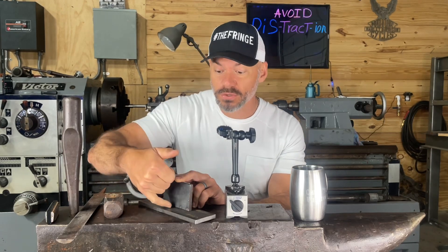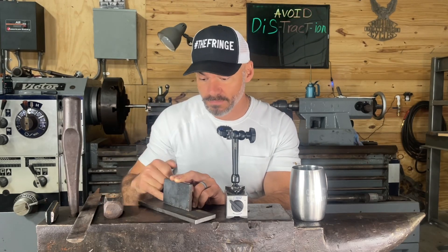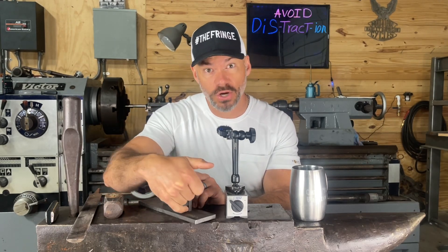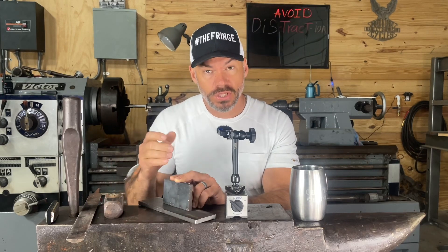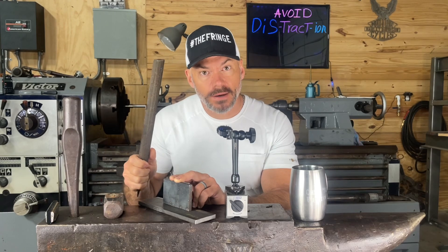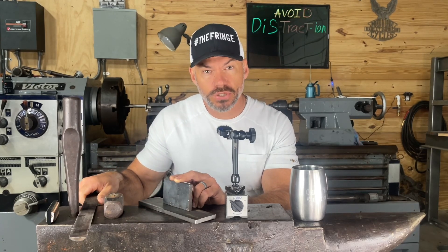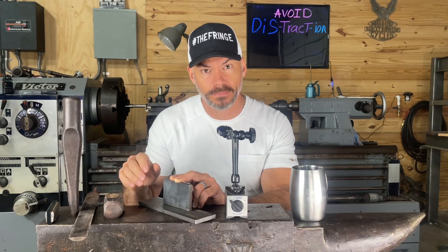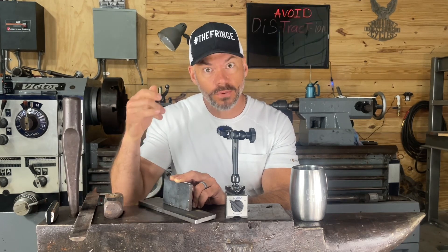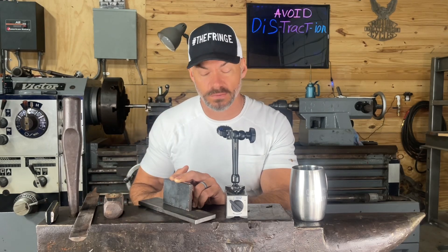When you come around, you need to wrap these corners. If you ever make a position weld or a structural weld and you don't wrap your corners, just think of me popping you on the head with a file — because you need to wrap all your corners. It looks stupid if you don't. Make every weld look sexy — the best you could do with what you had.